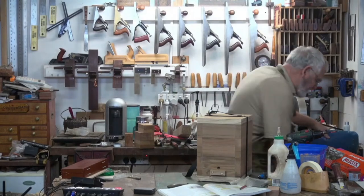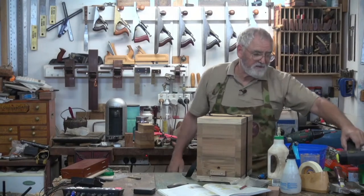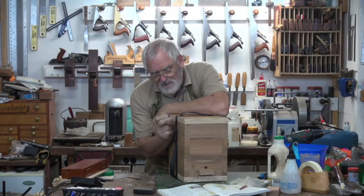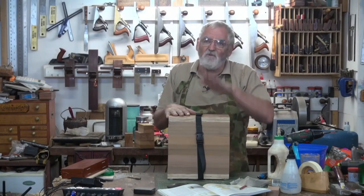Now, I'll show you, this is one that I hope it's dry, how to overcome some of the problems that box represents. The biggest problem with timber, as I mentioned at the very beginning of the stream, when we were sizing those edges to butt join them, is the end grain. Now, I understand if you are using pine or something, and a lot of people do, they paint the entire thing, and that's fine. If you're using internal plywood like this is, definitely paint it with a good quality outside enamel paint or acrylic paint, because you don't want the weather getting to it.